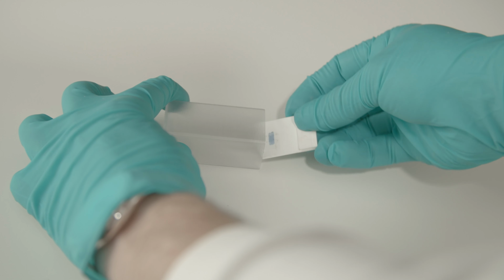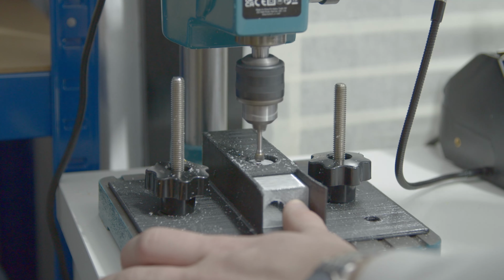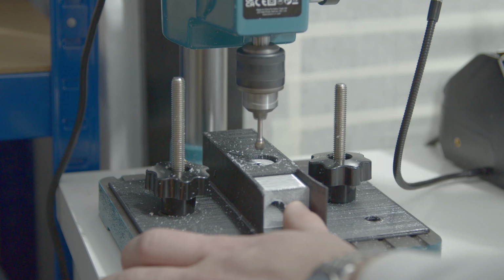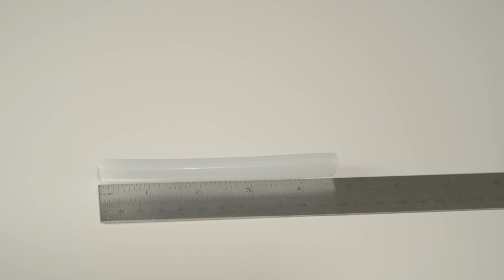The electronics box also needs a hole for the button, which I can't print due to it being done in vase mode, so I drill it after the fact. The hole is around 30mm from the top and 5mm in diameter. I have a special tool set up for it, but any drill will suffice. I'll probably make a version that doesn't need to be printed in vase mode, but it will be weaker, hence the original vase mode.